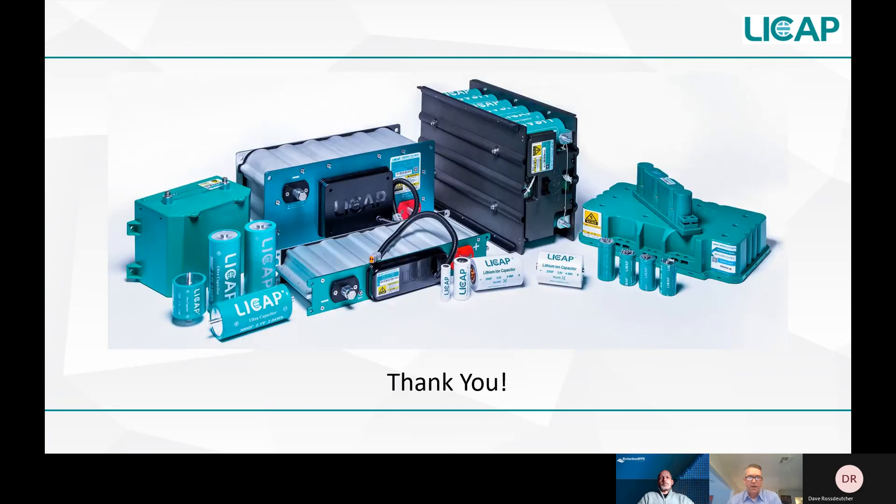This slide highlights all of the major products we have available today. We recently launched a new 3-volt, 3000-farad cell and have some additional 3-volt cells in development. A higher cell voltage can enable using fewer ultracapacitors to achieve the required system voltage and improve life performance. We're also continuing to develop our lithium-ion capacitor products in Sacramento, which also use our activated dry electrode. Lithium-ion capacitors have similar life performance as ultracapacitors, but about two to three times the energy density. Both ultracaps and lithium-ion capacitors are ideal for applications where energy storage is required but battery performance, life, and maintenance are a problem.